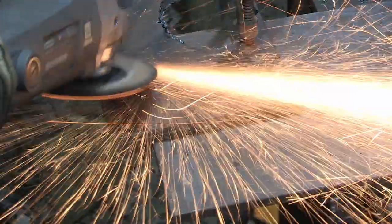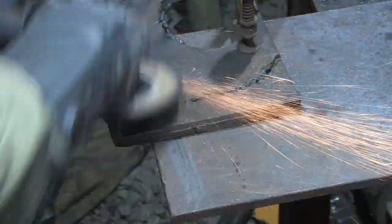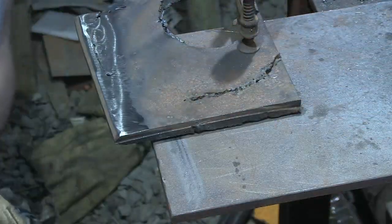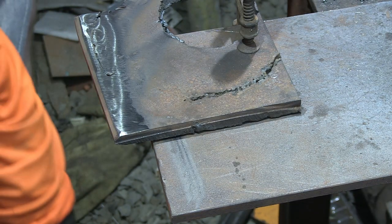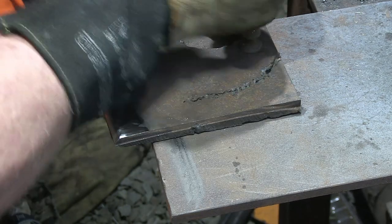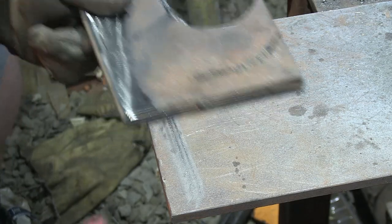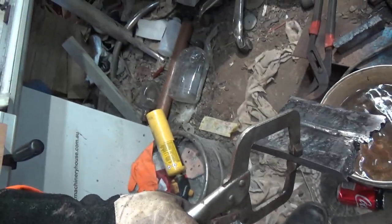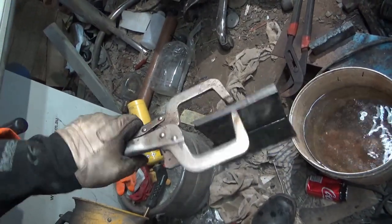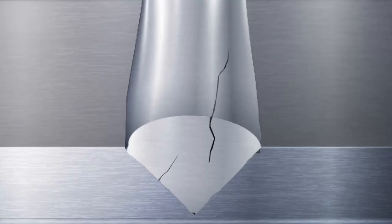Bad signs of a poor earth: the clamp sparking or getting hot, your weld arc stopping, or the electrodes sticking to your work. Line up your pieces how they're to be joined and clamp the hell out of them, because not only will they move at the exact wrong time while you're trying to weld, they will also warp, bend, and twist. The weld expands the metal and it contracts as it cools. Rapidly cooling in water makes this worse and can put micro fractures all through the welding area, so avoid throwing your pieces into a bucket of cold water.